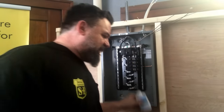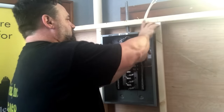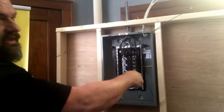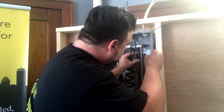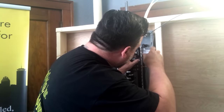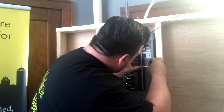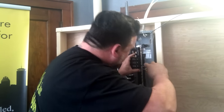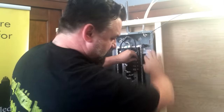So, let's land these, our circuit breakers, for our branch circuits. Same thing, push it to the wall. Make a nice little bend in it, make an L, then it's going to come out straight. So here we go. Bear with the noggin in here. I know the head's gigantic. It's like a giant bucket in your view. Hey, move your head. Can't you see the size of this thing? So, okay, we do the same thing and we land them.